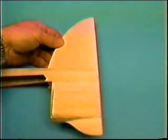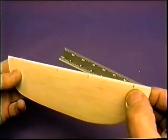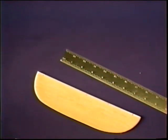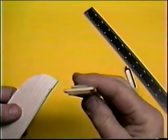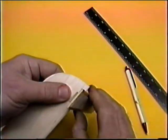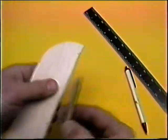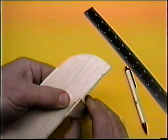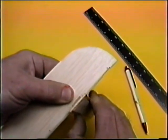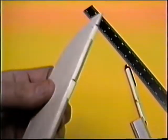Next thing I need to do is lay out where I want the hinges on this. Here we've got 2-inch spacing. Here comes the phone again. I have the tool, of course, that has one side for the smaller hinges, and we have some small IM hinges here that I don't know if we're going to be able to use or not, but this will get us relatively nice hinge pockets, and we need to get the hinges in place so I can do the final sanding and shaping.